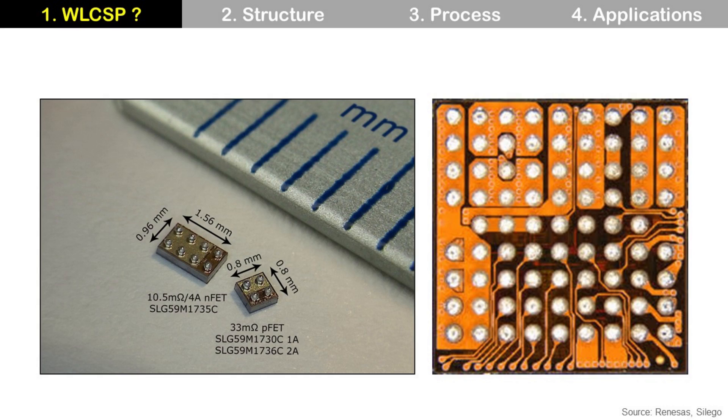The size of Wafer-Level CSP can be as small as 1×1 mm and up to 6×6 mm or even larger. But in most cases, people use Wafer-Level CSP for sizes less than 6×6 mm, because larger ones can have some issues for reliability.